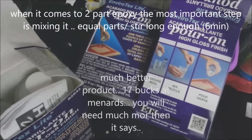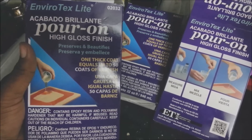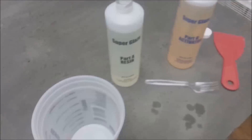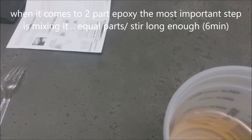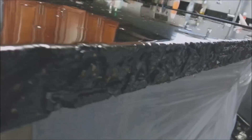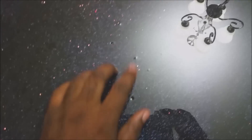What I'm going to do is use this two-part epoxy — it's a high-gloss finish, a pour-on epoxy. We gotta mix this for six minutes. Pouring B in, then pouring A into B. The edges look real nice — really brought out that natural cut stone look, a very rough-cut look that I was able to achieve with the caulking. I don't know why they sell those edge forms for so much money, because I didn't need them. Have fun with it if it's just a personal project like mine — gives a few little imperfections, but that's okay.